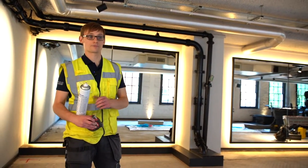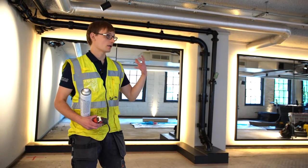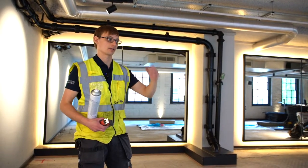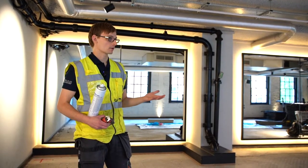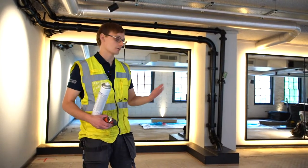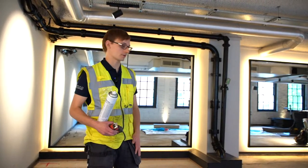Two ways of building a floor like this are either to float the floor on rubber or on springs. Rubber is fantastic for audible noise, for higher frequency continuous vibration — it does a fantastic job with that. But with that sudden bang, the impact that you get, it doesn't do a very good job at all, because that transfer of energy is pretty much instantaneous. That's why springs is the way forward for a job like this.